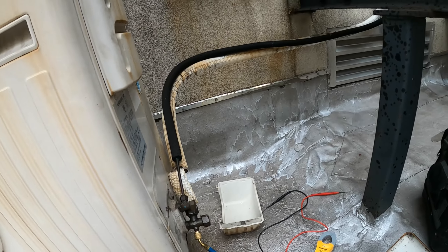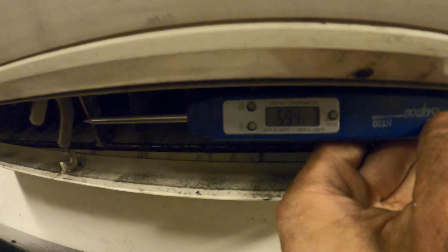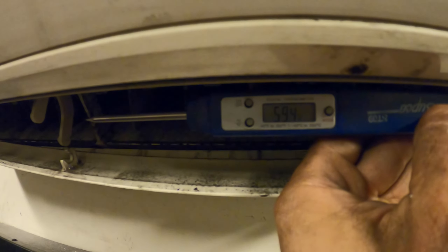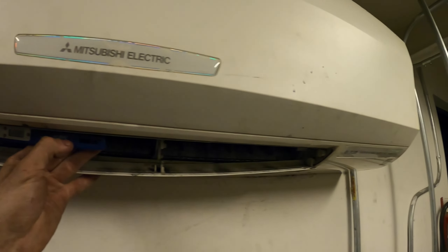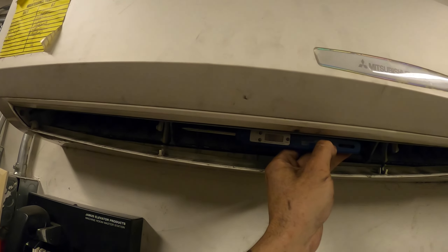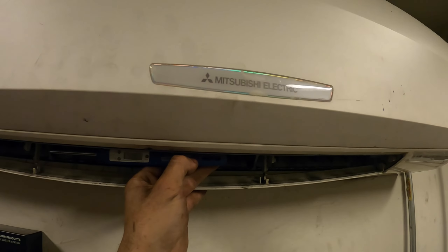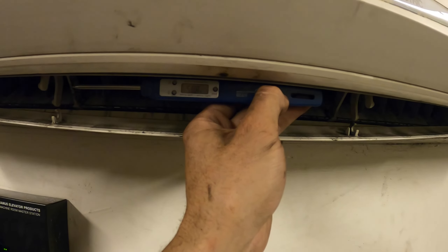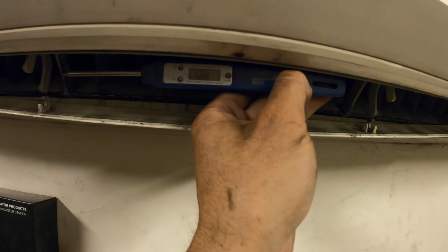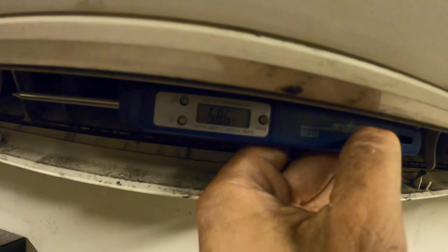Don't tell me this thing only needed to run and reset. You guys can see the temperature — we got 59.4 degrees and dropping. So we actually had no error codes here; everything was steady lights inside and outside. But what did we find? Those packed filters. I wonder if that did it — 58.6 and dropping.